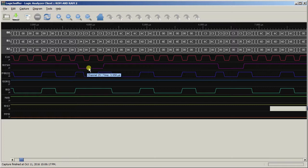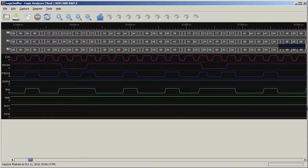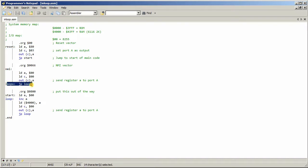And oh yeah, I was wondering why I was seeing 34 here. And then it's 35, but you've got to look, that's where the refresh is. I just wish there was a way to filter out anything with the refresh, because that's the only annoying thing about debugging the Z80 for me. Okay, so basically this says here, this is jump conditionally to address 006C, and that's what it does, 006C, and then says it again and again and again, because that's this line here.